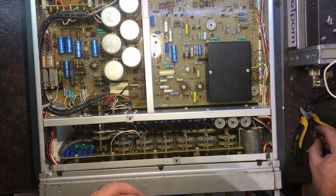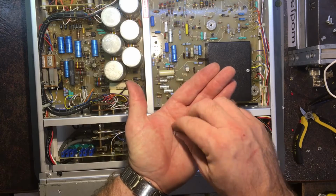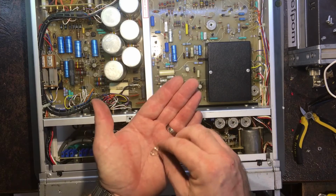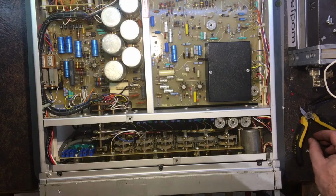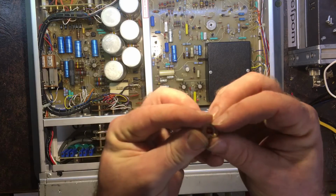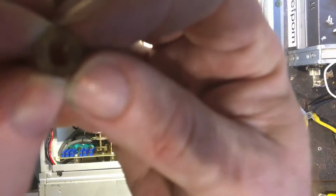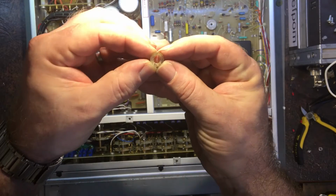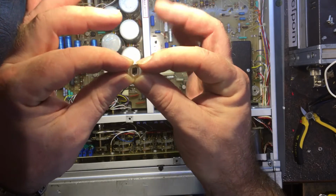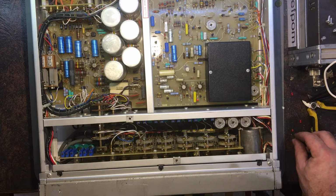Right, so that actually may be what these bits are from. These may be from that shaft there. Okay, so it's probably going to be a case of me having to use some epoxy to fix that. I thought they're from the standoffs because they're the same kind of material, but looking at it now, there we go. Put them together, and we have. Hope you can get on the camera and see it. Now I'll do it down here. It's a shaft. See the shaft shape there? Yeah. This is from that adjustment down there for that switch. So that switch coupling has failed. That's what those bits here are for.